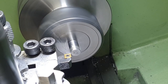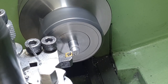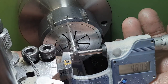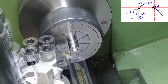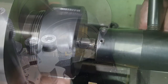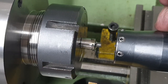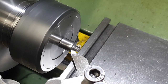The trailing and the driving crank pins all share the same key dimensions as the leading pins — that is a 9.5mm diameter for the part that fits in the bush in the coupling rods and the 8mm or 8.04mm diameter for the shoulder that fits into the wheel. However for the trailing crank pins I do need to turn the shoulder and thread this at 5/16x40 TPI, which is what I'm doing here. I also put a little undercut on the bottom of the thread.